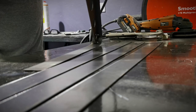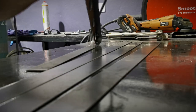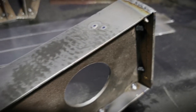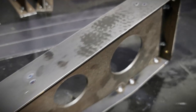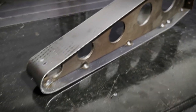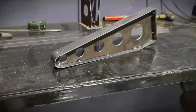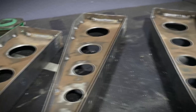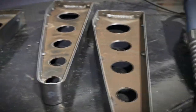What we're aiming for is to keep both pieces of metal close together all the way around the bend. Once we've got that completed we give them a nice bit of welding and there we go — a completed industrial-look bracket. After a little while we have four completed industrial brackets, all welded up and ready to go.